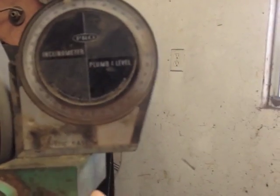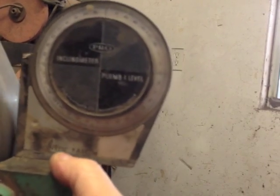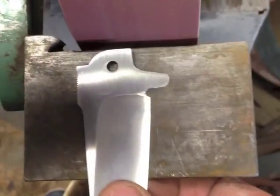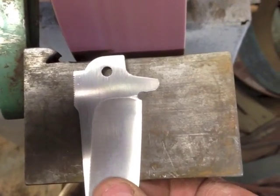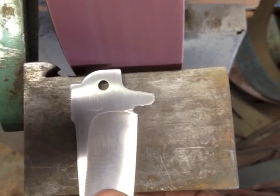Here it is in action. You can see that as I adjust the angle, the needle moves back and forth. It's kind of tough to see, sorry about that, but I'm going to adjust that for eight degrees and that's going to give us the angle. Now I'm just going to very lightly touch this and grind a little off. I just want to get an initial lock up to fit the blade in the knife.